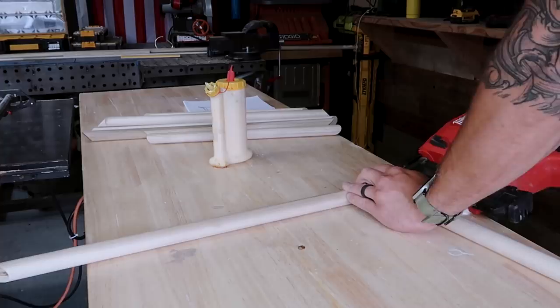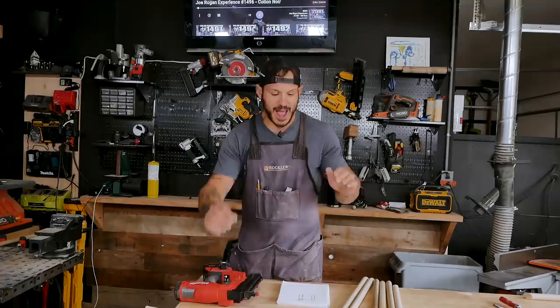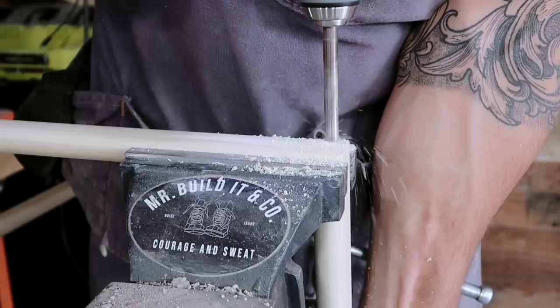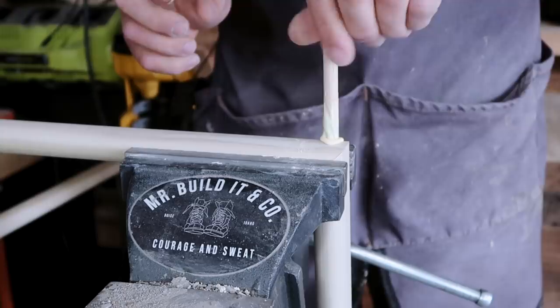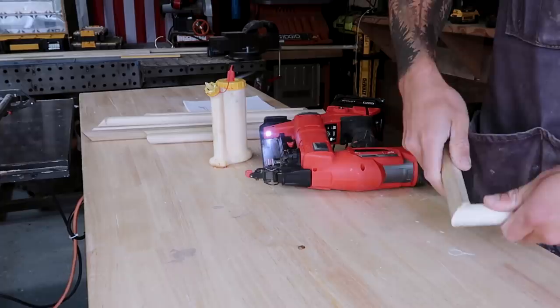What we're going to do is use some wood glue and a brad nail just to set it in place. Let the wood glue do its thing first, because securing it at an angle ends up doing a push-pull thing — it's kind of awkward. After it's all dry, I'm going to take this dowel, cut it to size, bore out a hole with a drill bit, and then puncture that in with glue. That is basically a tenon — like a mortise and tenon — and it's going to tremendously improve the strength of the structure so our cart won't fall apart after a push or two.